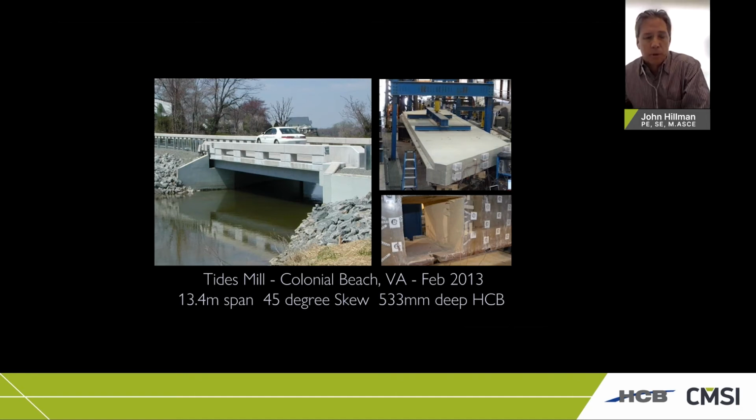And the comparison was the Abaqus model. They had already modified the Abaqus model to say, okay, what should the capacity be if we had this kind of damage to the bridge? And the Abaqus model was wrong. And once we got to the point where we expected it to fail, we pulled out all the sensitive equipment so we wouldn't break anything. And I ran a quick calculation on my HP 15C on my smartphone and said, well, if I got 10 strands at 100% GUTS and I got this moment arm, what would the failure load be? And I calculated it exactly correctly. And I can't remember what the number is off the top of my head right now. I want to say it was 86,000 pounds of load that we put on a single beam.